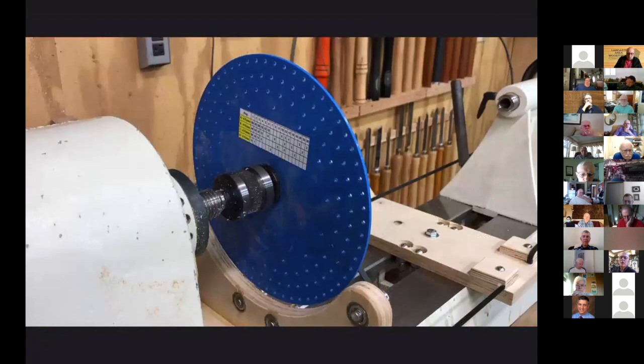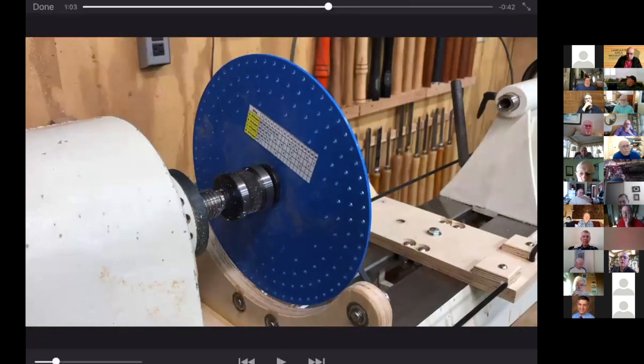And this is something that some of you may have around your shop, some may not, and that's right behind the blue plate. You'll see it's a live 1-inch 8 spindle. It's got a Morse taper on its backside that goes into the lathe, and then that thing itself rotates freely. And if you have a more expensive lathe than mine, like Robust or whatever, any of those that have a true readout on variable speed and are not driven by tapered pulleys, your spindle is free enough to rotate that you don't need this kind of live center.